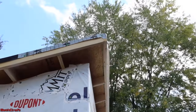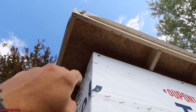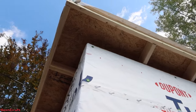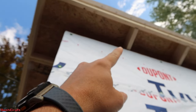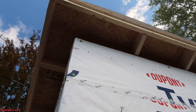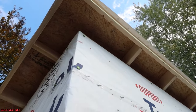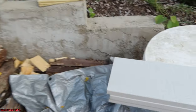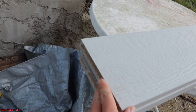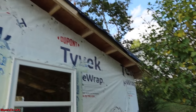The first step to get the fascia and soffit installed is to do a little bit of blocking up under here. You'll notice that there is nothing to attach to on this corner, so we're going to be doing two blocks. One is going to go from this edge right here over underneath this and attach to this rafter over here. Then after that one is installed, we're going to do another block from this corner here for extra support on this gap. The material going on the fascia is called Miratec — it is a compressed wood and it's been primed already. We're going to be using the other side which is smooth. So let's go ahead and get started getting these blocks installed.